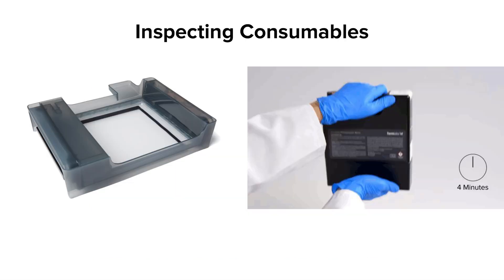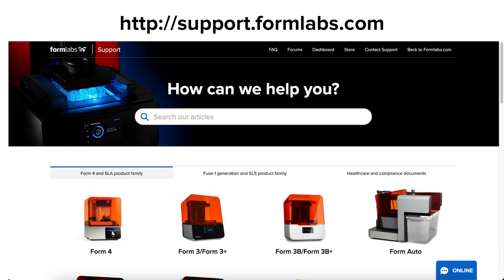Finally, it is important to regularly check your consumables. Resin tanks should be inspected regularly for damage and wear, preferably before you begin any print. Always pay attention to tank lifetime warnings and replace expired resin tanks when indicated. Resin cartridges in storage should be shaken every two weeks, and always shake your cartridge prior to each print as pigments and additives can settle. Pay attention to expiration date labels and dispose of expired resin according to local guidelines. The Formlabs support team is here if you need us — go to support.formlabs.com to search support articles, use the chat feature, or click 'Contact Support' to open a ticket.